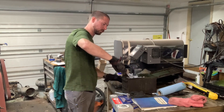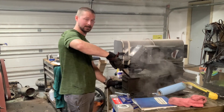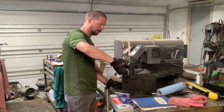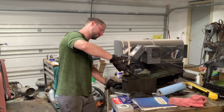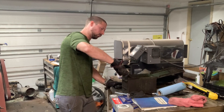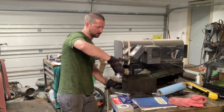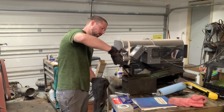The one I just pulled out was a damascus scout knife. Damascus tends to warp too, so I always plate quench that after oil quenching as well. This one right here is 80CrV2 steel — my scout model. Very rarely will this stuff warp when heat treated this way. About 15 seconds in the oil.